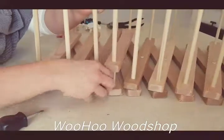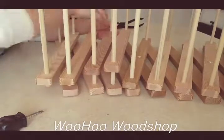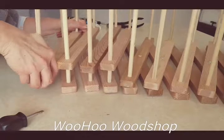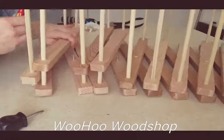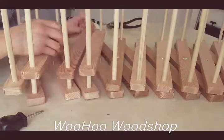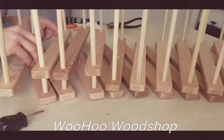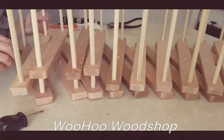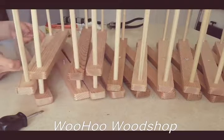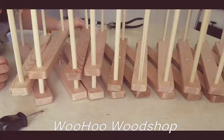And if these pieces seem to be stuck and not moving right, it's probably because they're crooked. If they're straight, they should slide. If they're crooked, they'll jam up, and you'll have a little trouble with them. So, let's see what I'm doing. I'm going to put a little thread locker in all 4 of them at the same time. That one dripped a little bit. I want to make sure that we're not going to make a mess out of this stuff.